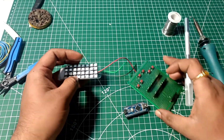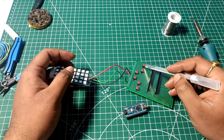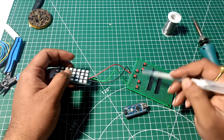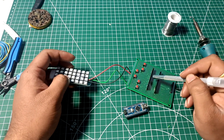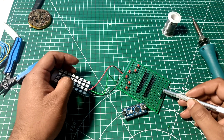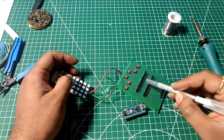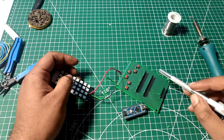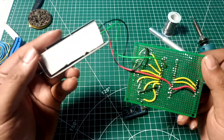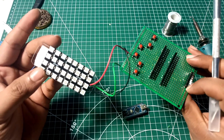The six push buttons are connected from digital pin number 2 to pin number 7. So pin 2, 3, 4, 5, 6, and 7. Now for the OLED display — the positive and negative pins are connected to Arduino's power and ground. The SCL pin of the OLED display is connected to A5, and SDA is connected to A4. I will give the link for the circuit diagram in the description so you can download it.